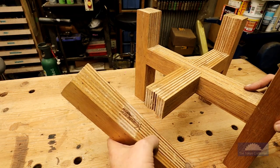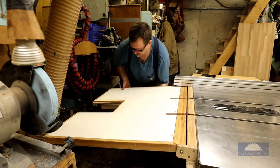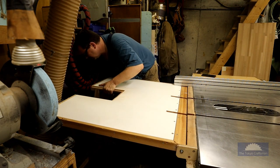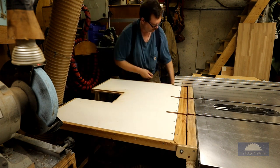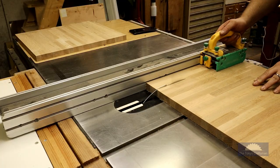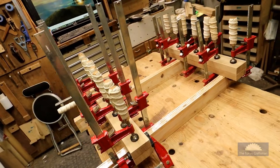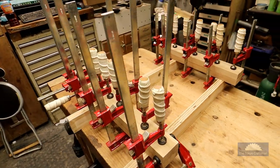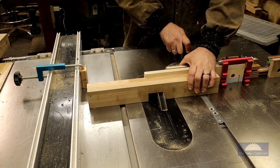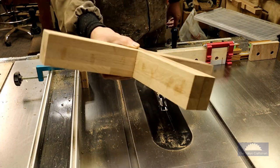Here's a close-up of the old stand, which is obviously broken. This is a flip-off table I built for my SawStop — saves a lot of space, works really well, simple design. Now cutting stock and gluing up some pieces for the crossbar that sits on the bottom. Here I am putting the first dado or groove cut in. That's the two pieces fitting together — the joint was a little loose but it's okay.